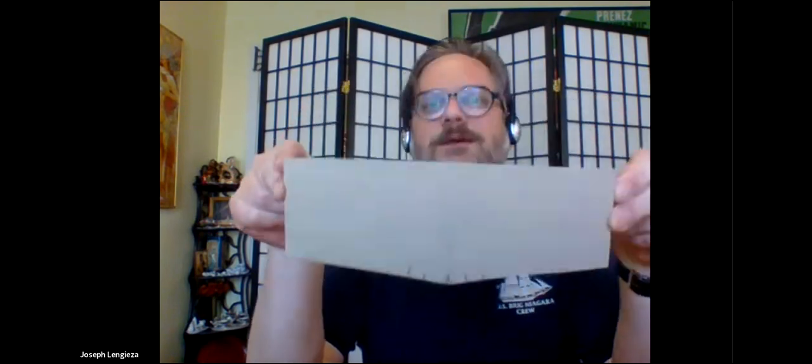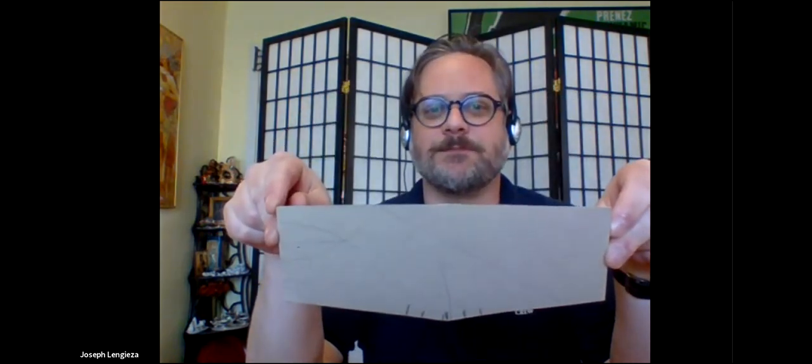And this can either be a series of the same angle or different angles as you go. So how do you do that without being able to read, write, count past 10, what have you? One of the simple ways, and ways known in antiquity, is the control level. So here, made out of cardboard, not lumber, but ready to go to the shipyard today, is a basic control level. I made this by eyeball. I think it's about 9 degrees per side, giving a total angle of about 18 degrees.